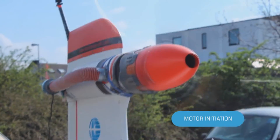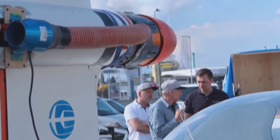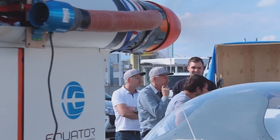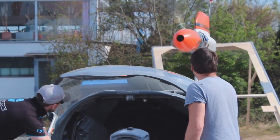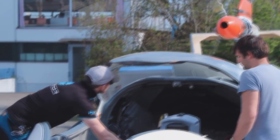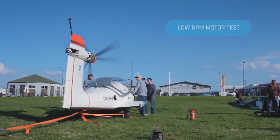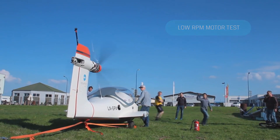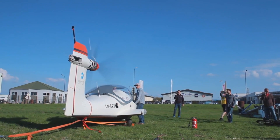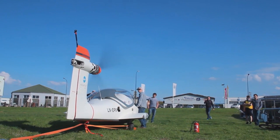It's also a fly-by-wire rudder and fly-by-wire nose gear. Taking away the pedals makes it even more like a boat, and the idea is that people will learn to fly easier because you have fine motor control in the hand. The brakes on the wheels are in the throttle handle, so once you pull back and the propeller stops, you go on the brakes. The cool thing with the electric engine is you can reverse the propeller in the opposite direction, giving you a brake in water — and you can also back up in water.